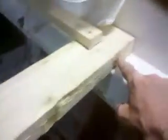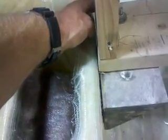Alright, so this is the bracket that I built for my motor mount. The way I did this was I made these outriggers so I'd know exactly, and then I marked it here, and these outriggers will go back against the part right there, and then simply measure 22¼ inches, and this pulls up like that right there. So that's where the mount actually goes. When I set that off, this is pretty close. I got 2 more layers to go on this, so I think it's going to be fairly close to dead on the money. At least 2 more layers. I may do an extra pad right there.